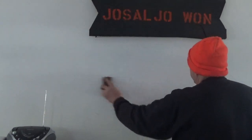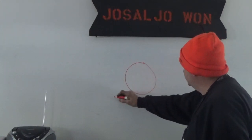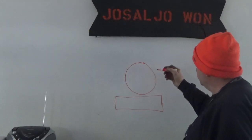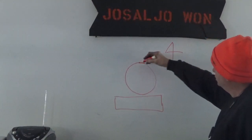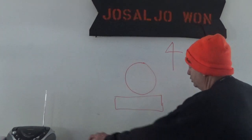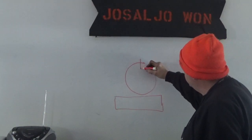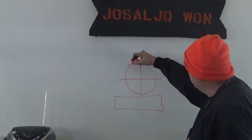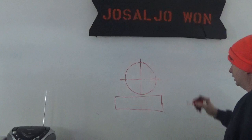So the question was, how do you center a log? Well, it's not that hard to center a log because you have the bunk. You can buy tools — they make a thing that you put on the log and it'll automatically find the center of the log for you. But you don't really need that unless you're trying to be really precise. Basically, just put yourself a target on there, and wherever the lines cross is pretty much the center of that circle.